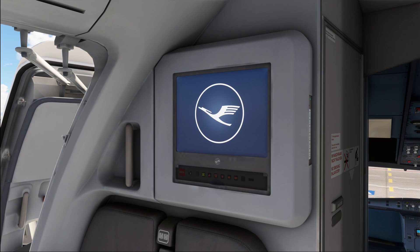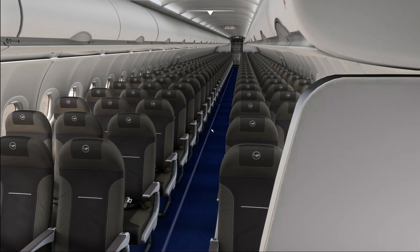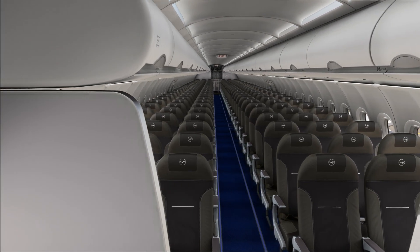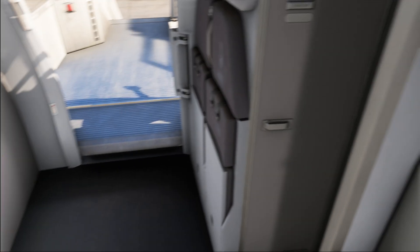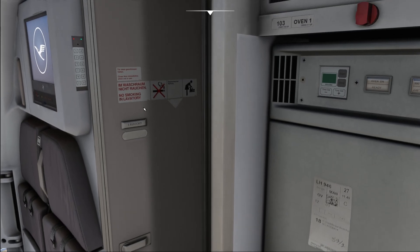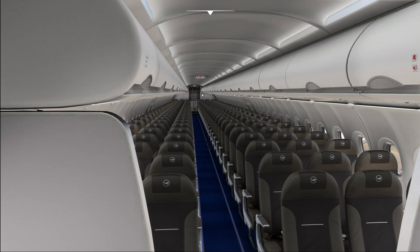The system itself works in a rather simplistic way. The water tank is located roughly in front of the wings and is pressurized by bleed air, which is used to pump water to the galleys and lavatories alike. The same tank supplies water to the front — for the toilet and coffee maker — and of course the same thing for the back of the aircraft.